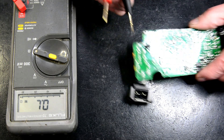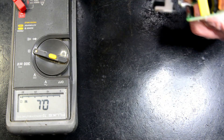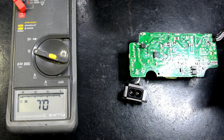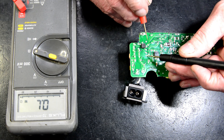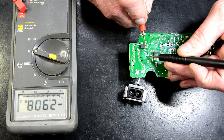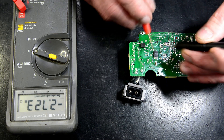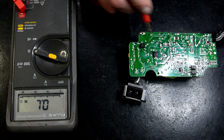Now we've got our bridge rectifier. Basically, our 240 volt comes in through this bridge rectifier — which is a bunch of diodes — and then comes out the other side. What I like to do is measure out on the secondary side, which is the two outside points, and see if there's a short on there. There's no shorts on there, okay. There's also another diode there — we'll quickly check that one.